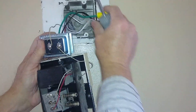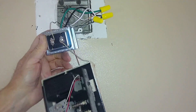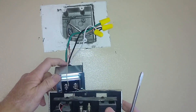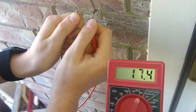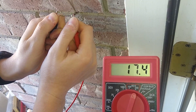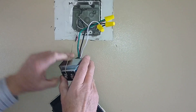Got the new one secured. So at this point, before you get everything back screwed in, this would be a good point to test and make sure everything is connected. We'll go flip our breaker back on and test our doorbell to make sure we've got everything right. We just got our multimeter back — testing the doorbell again. This is good news: we're at about 17 volts, so the transformer is working. We tested it and everything's good.